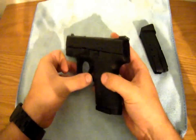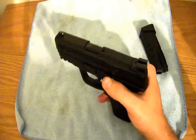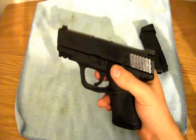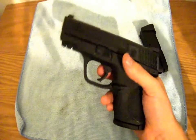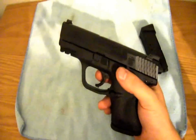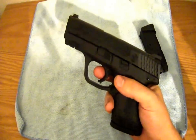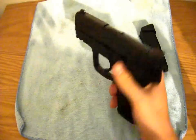Safeties — this one has a lot of internal safeties, just like a Glock. It is striker fired and does have a firing pin block. When you rack the slide back, your striker is only at half tension, so if it somehow went off, it would hit your firing pin block. And if the firing pin somehow did fire, it wouldn't strike the primer hard enough to ignite it. You have to pull the trigger all the way for it to hit full tension and release the firing pin block. It's a very, very safe gun — could get run over with a train and shouldn't misfire.